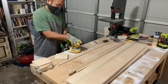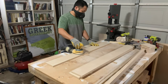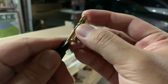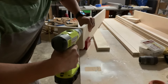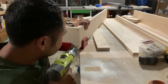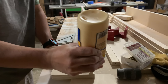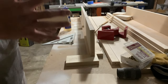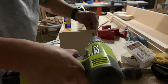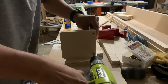So then it was time for some sanding. Since the three-quarter inch birch I was working with was already relatively smooth, I ran over all the pieces with 220 grit on my random orbit sander. Next it was time to drill pilot holes and countersink them — I'd be using inch-and-a-quarter screws to join these together. I also used a right angle clamp to make sure everything was square. After all the pre-drilling I took some wood glue and assembled everything. Generally I'm lazy and don't pre-drill, but since I was drilling into the end grain of plywood I'm really glad I did.